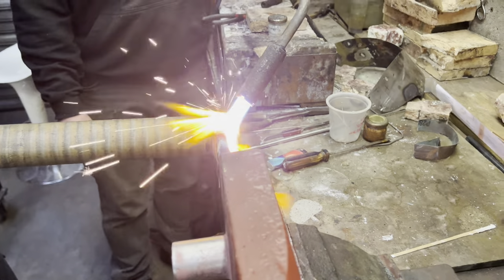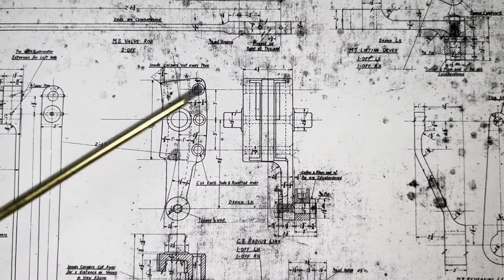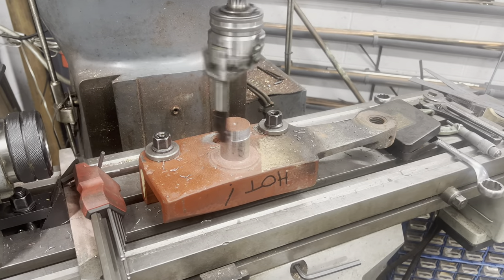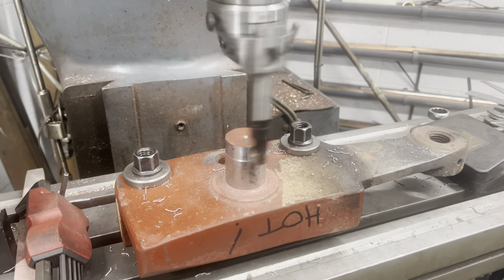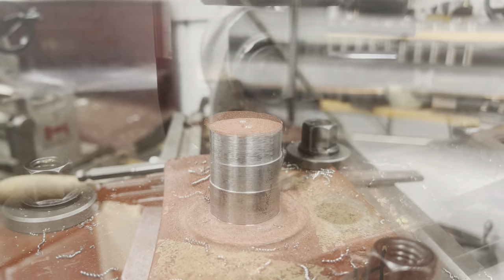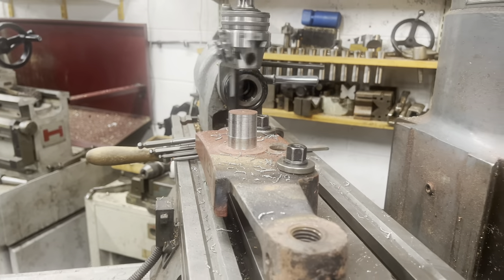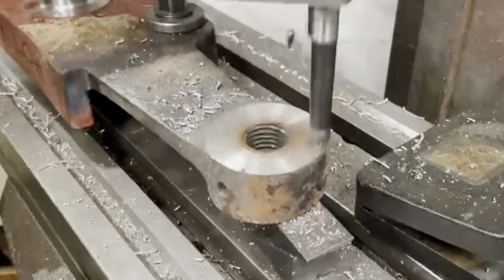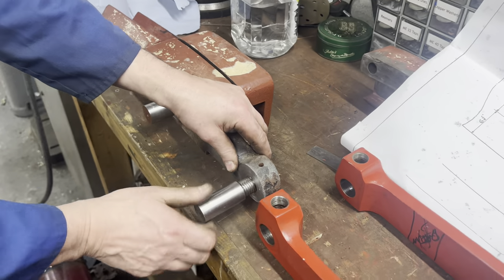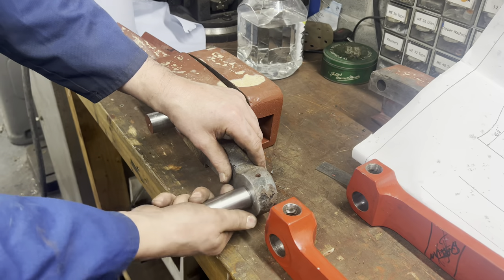Once straightened up, the drawing shows the two pins sticking out either side. We had to skim them on the milling machine to make sure they were absolutely parallel with a nice surface to go into those bearings we made earlier. This is fly-cutting down the surface — we did the horizontal surfaces as well, both around the pin and up at the top end for the actual drive pin. Then Neil is here test-assembling the whole thing so you can see how the pin goes in the end of the eccentric rod and how the whole assembly goes together.